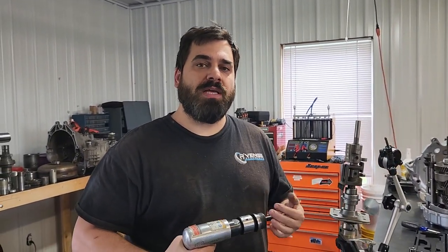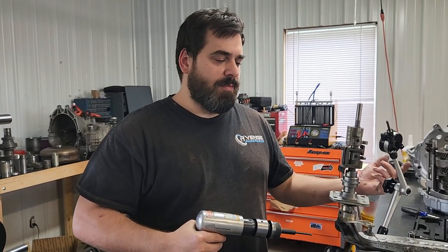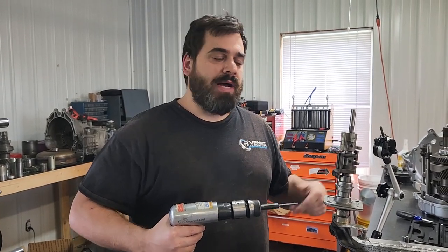We typically replace the roll pins. It's a 6 millimeter roll pin by 30 millimeters long — we do sell those on the site for a couple dollars if you need them. If you don't shoot them across the room, you can find them and just put a little Loctite on them when you put them back.